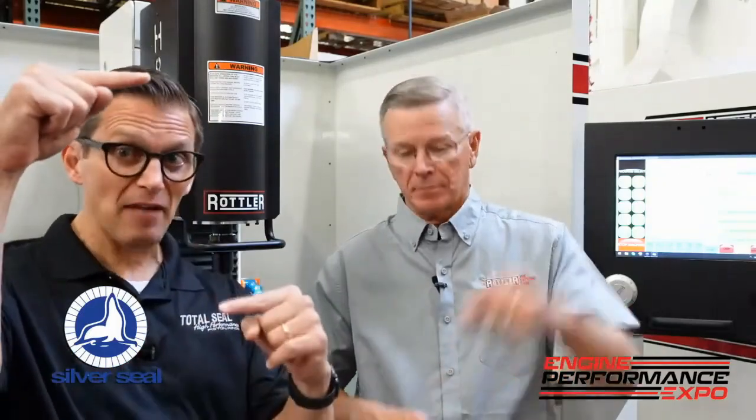It's a very definitive plateau. Well, I know a lot of guys are using what's called the RZ, which is the peak to valley distance. And they're actually using that as their guidepost when they finish their roughing abrasive, to make sure they have enough RZ before they begin plateauing, so they know they don't take away too much. If you don't have enough RZ to begin with, you can't get there. That's right. RZ is the distance from the highest peak to the lowest valley.